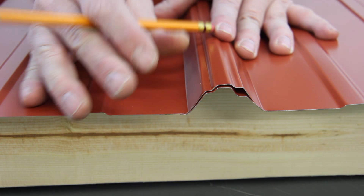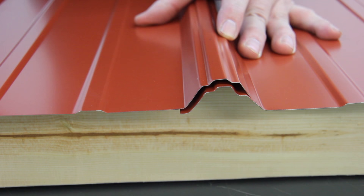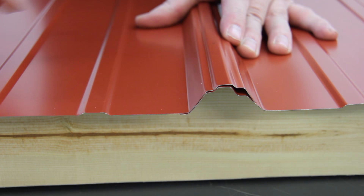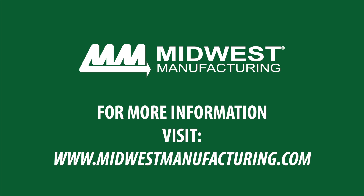It's very easy to get underlapped or overlapped because most roofs are out of square, and as you're squaring up the steel, sometimes you're pushing and pulling on it and it goes one way or the other. It could be one way on the bottom and another way on the top. As you work your steel and fasten it, you always want to fasten the overlap first before you fasten each of the other ribs — that way you have it locked in and it's going to drain properly.